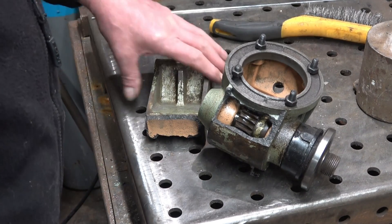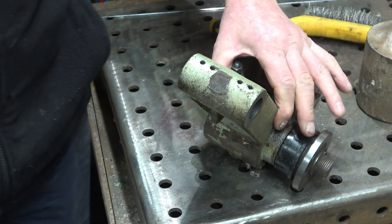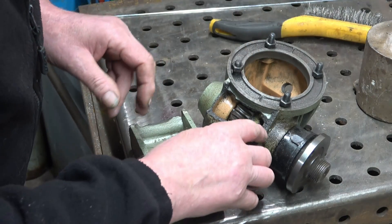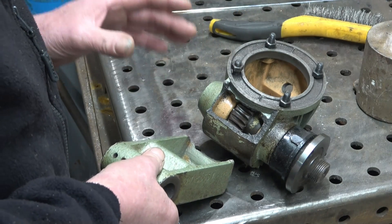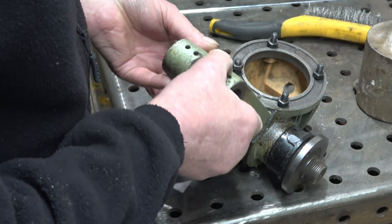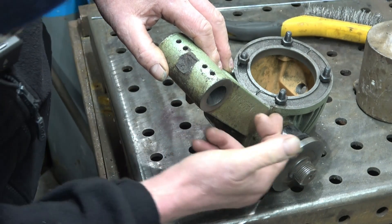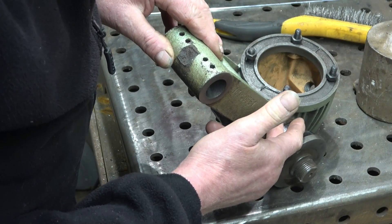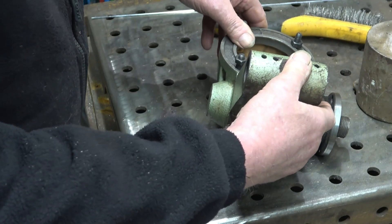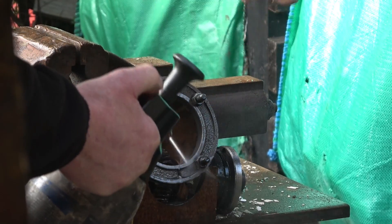It's pretty obvious what I've got to do here - it's been dropped, a machine fell over and smashed that big lump off. This is cast iron. I'm going to give it a wash with brake cleaner to get as much oil away as I can, but cast iron is impregnated with oil - that's one of the major problems with welding cast iron. I'm not going to weld it, I'm going to braze it using TIG and silicon bronze. I'll get it cleaned up, lay the pieces together, get some good tacks in, use a ball cutter die grinder to get some penetration, then preheat it and braze it with silicon bronze for a good repair - and make it oil tight. I'll make sure all the brake cleaner is gone before welding, because it puts out nasty fumes.